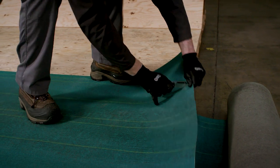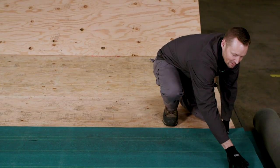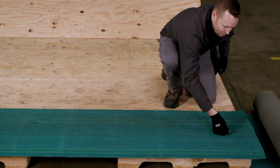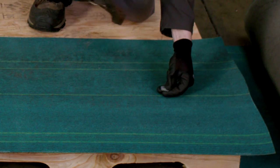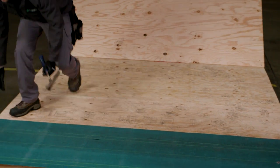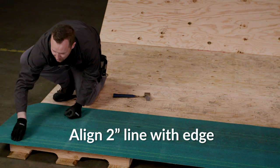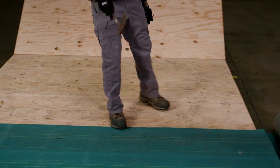In order to set my course, I'm going to line this two-inch line at the edge of the roof and make sure it's straight down. I'm going to put a nail here to begin, nine inches off the edge. I'll come to the other end of the sheet, align it with the two-inch mark right on the edge, and begin my nail pattern of 18 inches.